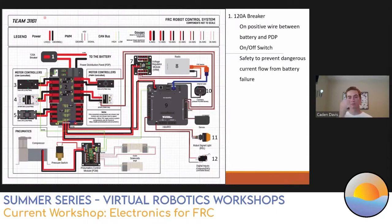Are there any good practices for crimping? Invest in a dedicated Anderson power pole tri-crimp tool. Crimping can almost always be done with just a pair of pliers, but a dedicated tool makes it easier with a lot less risk of connections coming loose - and one wire coming apart can easily shut down your robot. What's the most important part of electronics? Having good practice and being careful, because it's such an interconnected system. If you cut off power to one component, it can lead to shutdown of many others. Always check your connections, make sure cables are held down with zip ties or tape so they don't get caught, and make sure wires aren't pulled out when changing components like a gearbox.